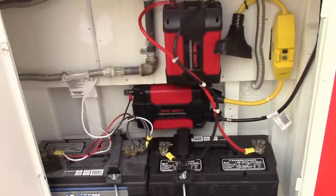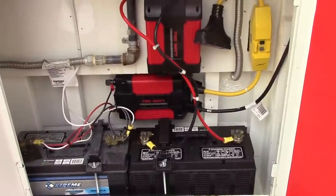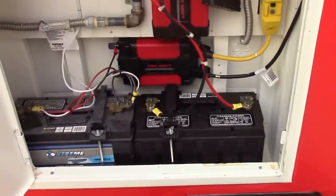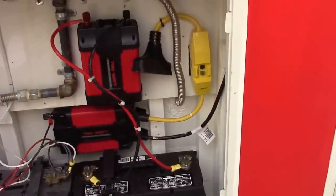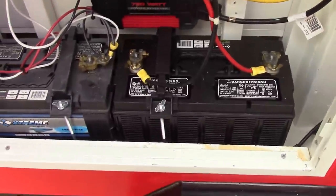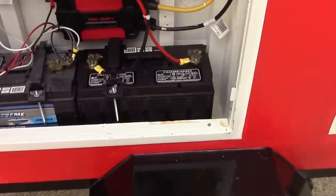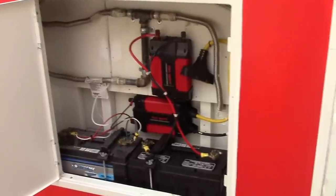I've got two 750-watt power inverters — one I was using to basically run the refrigerator, and another one I'd run lights off if needed. One inverter goes to one battery, the other to the other. Because I'm kicking it over to 110, I put a GFI setup in here to protect myself since I might be in a wet location outside. When I figured out the math on these batteries, I should be able to run that refrigerator on a full charge for at least 24 hours. Because of that capability, they gave me permission to go anywhere in the state when I got my license on this. The guy actually told me it was the nicest homemade cart he'd ever seen.